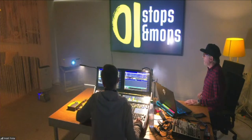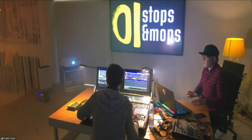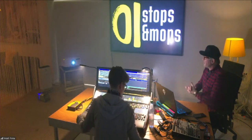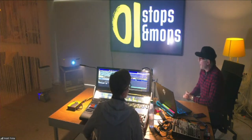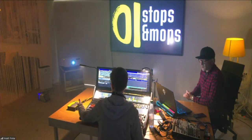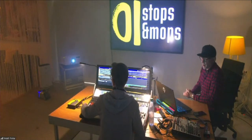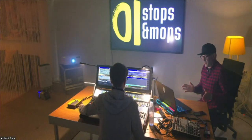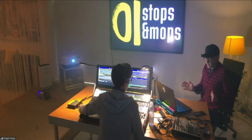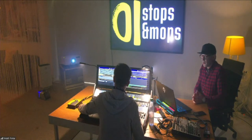Okay. For the lighting source, which is important to know and understand with DeskDAO, as it is an external system, for now we're using a Christie Digital projector, a 6,500 ANSI lumen DLP one-chip projector. It's quite affordable, but bright enough to light up a club scenario stage-wise. We're using it with a 0.9 lens. This is important when you think of lighting: the smaller the lens gets, the more we increase light output. And we're using a pretty wide lens here to have more opportunities.